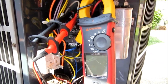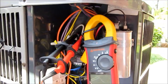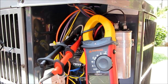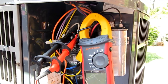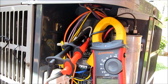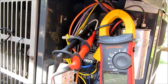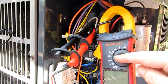Basically, it's going to be on my amp probe, which I think is one of the best meters on the market today. I'm not going to bash any other meters — I think each meter on the market, especially the ones we use in the HVAC trade, are actually fantastic meters with their own functionality. As for the amp probe, one of the best reasons I bought it is it actually does inrush current. Several meters on the market do inrush current too, but the other main reason I bought this meter was the ability to do wattage, along with being able to test flame sensors and whatnot.